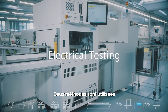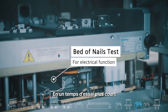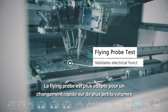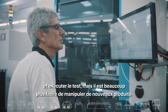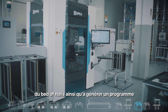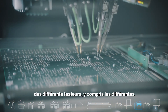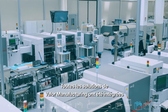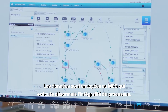There are two methods used to perform electrical tests on the PCB. Bed of nails is used for high volume — it allows for shorter testing time but requires expensive development of fixtures. Flying probe is used for high-mix, small-volume production — it takes longer to program and run the test, but is much easier to handle for new products. Valor process preparation can help plan the bed of nails fixture and generate programs for the flying probe. Valor IoT collects data from the different testers including electrical measurements and pass/fail results. All Valor manufacturing solutions have been integrated into the CamStar electronics suite, and data is sent to the MES which runs the entire process.